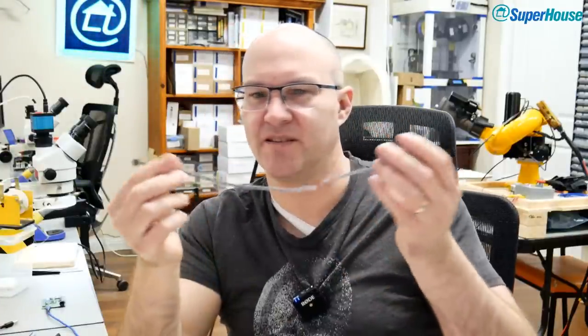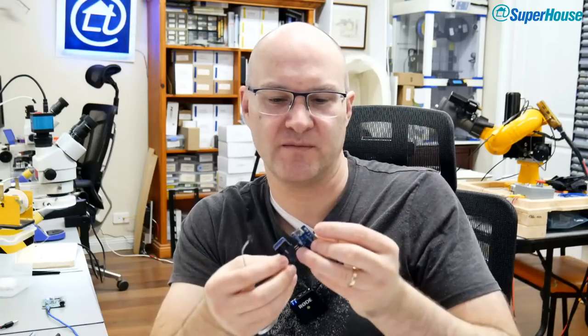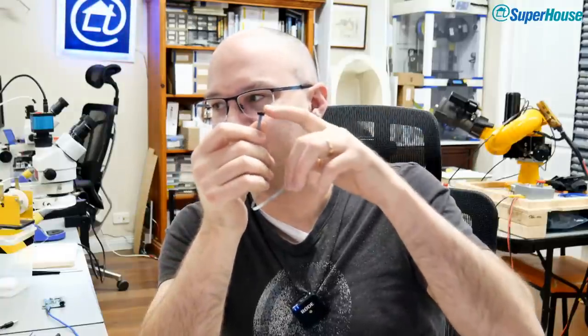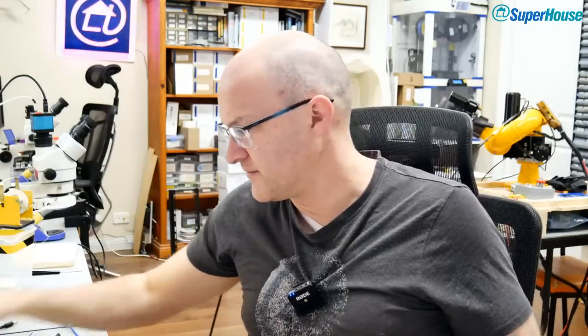So yeah, it's really cool having a board with an IDC header for the programming connection, because it means that you don't have this plugged into it and then a bulky USB cable that sort of drags the board around on the bench, and it's not very convenient. Using this combination, I actually really like this. So 2x3 IDC header, 1.27mm pitch, so the whole thing is very, very small. You just have this sitting on your bench, plug this into your target board, and then you can do reflashing. So that is working out really well.